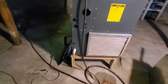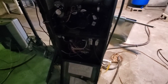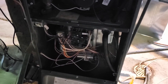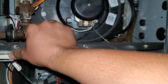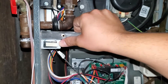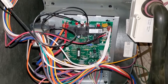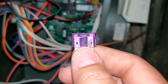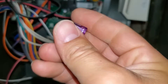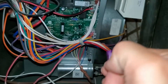Plus, having the power turned off while you replace that fuse is a good idea. Even though on the front of the furnace, like we were just looking at here a minute ago, you saw me press that switch — that right there at the top corner, that's called the door switch. So when we press this, it connects power, and when we release it, it disconnects it. But it's still safer to have it turned off in the breaker panel. So we'll go ahead and leave that off and then we'll install our new fuse. I'll put a link right at the top of the description for you guys if you need to buy a couple replacement fuses for your furnace — these little 3-amp fuses are pretty inexpensive.